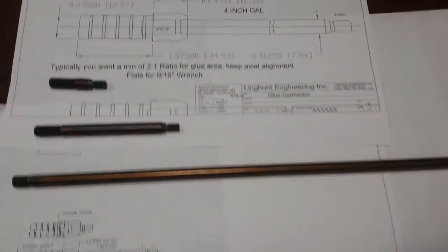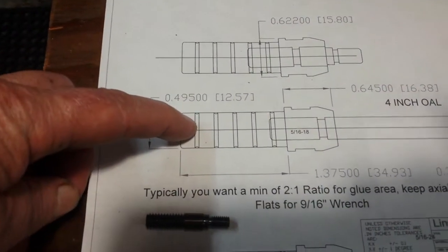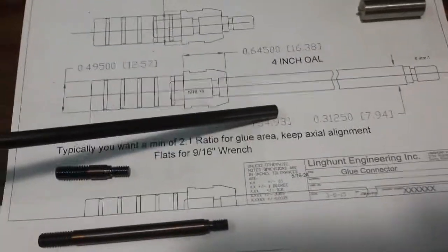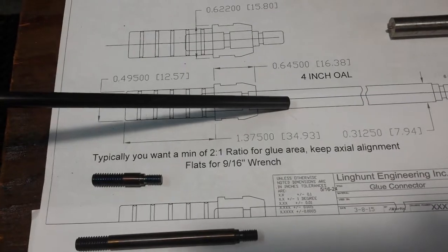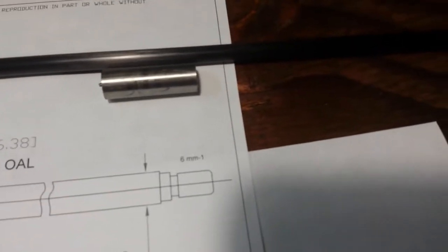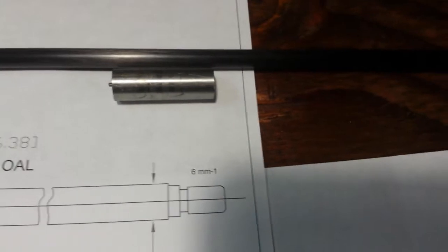The other thing I could do for you is take this base here and drill a hole in here. And then if you mounted a piece of carbon fiber, stick that in there, that'll give you some more rigidity to what you're building and not really add that much weight. And on the other side of it, we can drill, take a piece of 1/2 inch and I'll neck it down so it'll fit in there, and drill a hole in that.